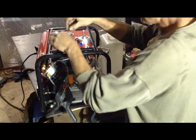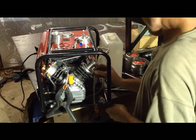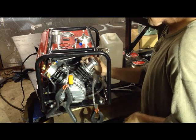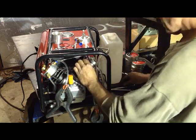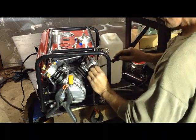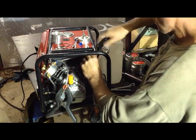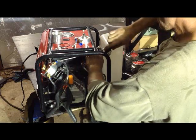Back down to home. Take the four shorter bolts and stick them right back in the holes, tie them back up — it's absolutely just the reverse. The main purpose of this video is to show you the components, how it works, and how easy it is to do an R&R if you ever need to. The components used — silicon bronze against stainless steel — are going to last virtually forever. The enemy of any of this is heat, which is why we went with the cooling system we did.